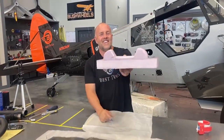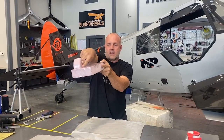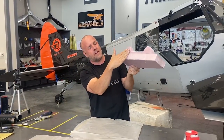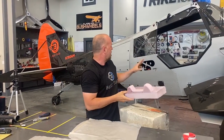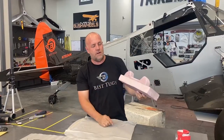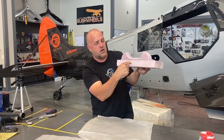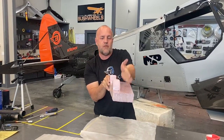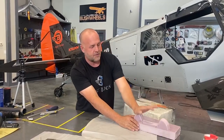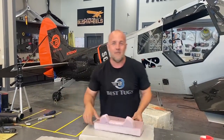Okay, it looks silly and quick. I've got it set where this side is going to make a carbon fiber 90-degree lip, this side is going to come down flush. I'm going to run the carbon long — that's because where it attaches for the throttle quadrant assembly, this side will go flush and will screw into the existing carbon fiber, and this will screw into the edge right before the window so my hand can rest here to run the throttle. Let's knock it out — back to work.